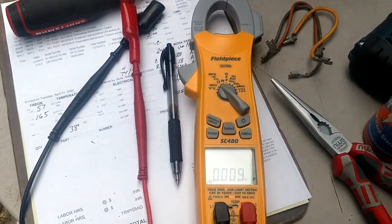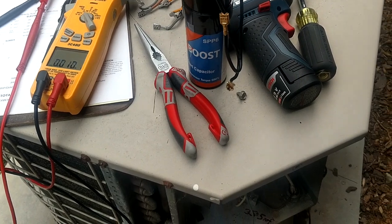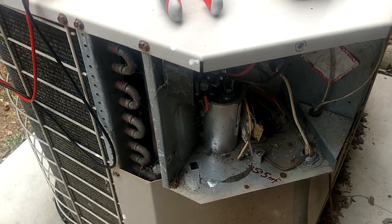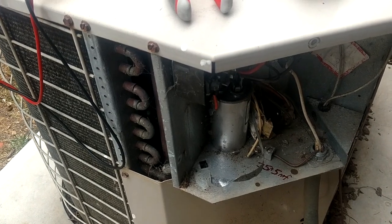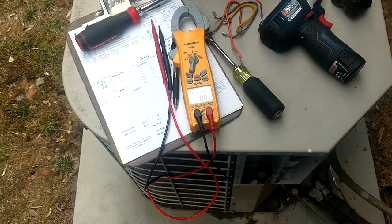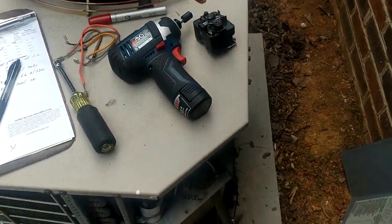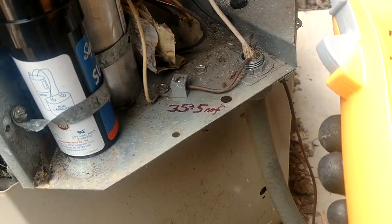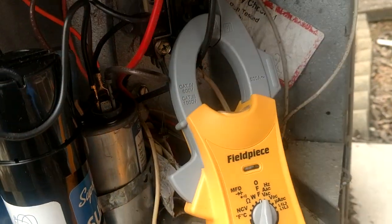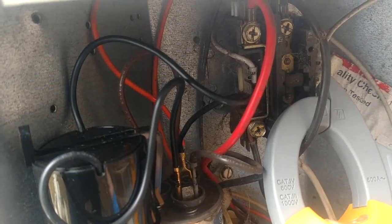The other start capacitor was completely dead. Give me just a minute — we're going to hook this thing in here. We're going to try to make it look as pretty as we can, and then we're going to take an inrush current on startup on this thing. I'll be right back. Alright you guys, so we've got it in there most of the way for now. We'll tidy it up a little bit more when we're done. I'm going to go ahead and hook on to my black common wire there.